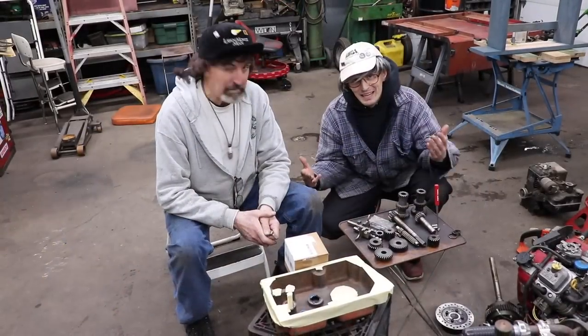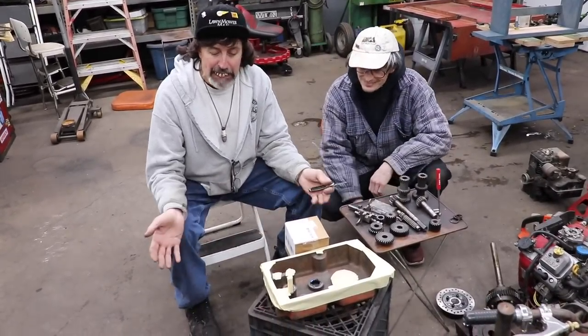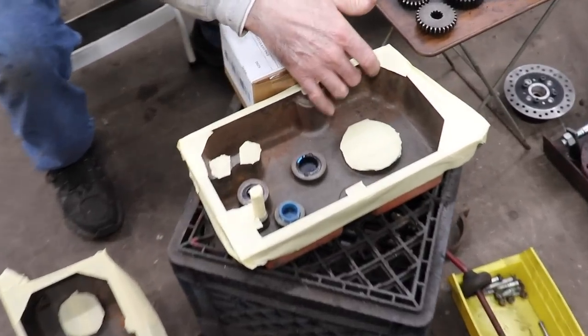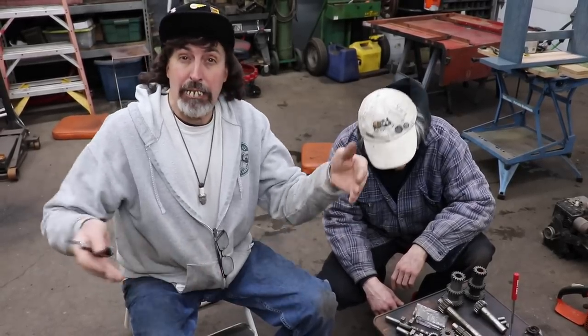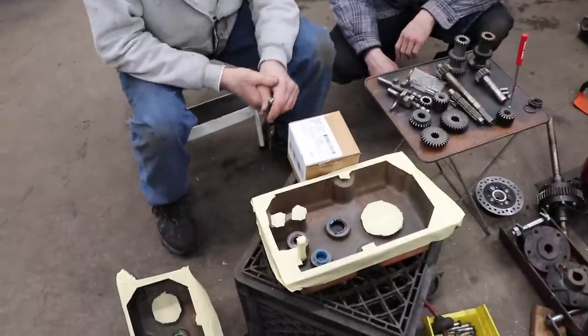Hey, what's up? We're back. And we got some stuff. We got the tranny apart. Got it all cleaned up. And it was rusty up here at the top. So I remember years ago when we did engine rebuilds on car engines, they would tell you to paint the inside, where the heads go, where the intake manifold goes, so the oil would run off faster. So that's what we're gonna do. We're gonna paint the inside of this transmission